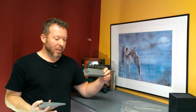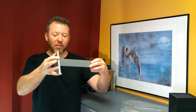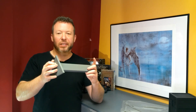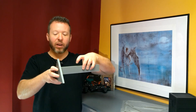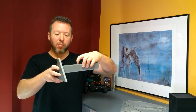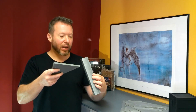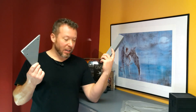But it taught me that if you have something that vibrates, potentially you should orient your layers in a different fashion. You should have the layers go with the vibration direction, not perpendicular to it, because then it snaps off right in between the layers. Which obviously with this part design doesn't work, so I had to come up with something else — I'll show you later.